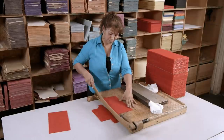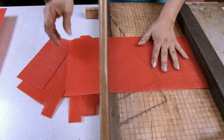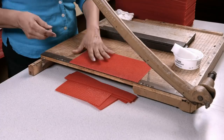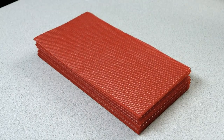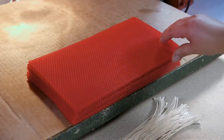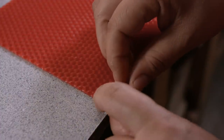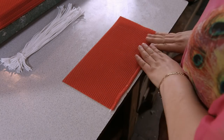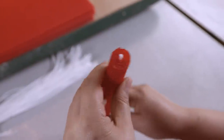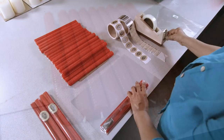To make them into candles, the sheets are cut to the required length and width — the dimensions will vary depending on the size of the candles to be made. The offcuts will be melted down and reused. These beeswax sheets are now ready to be made into candles. First, a cotton wick is positioned on one edge of the sheet. The wax is then wrapped around the wick, and gentle pressure is applied as the sheet is rolled — because the tighter the roll, the longer the candle will take to burn. Being made at room temperature means that the wax is warm, so the layers adhere together.